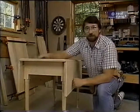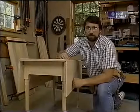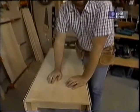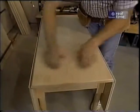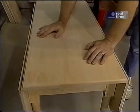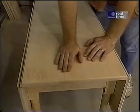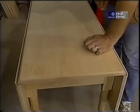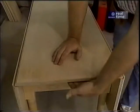This one is made from glued-up stock rather than single boards. Most of the pieces we looked at had a severe cupping problem — the boards were curled. And that's because of uneven moisture absorption. They might have had a finish on the top but none on the bottom, and the top might have received direct sunlight but none underneath.